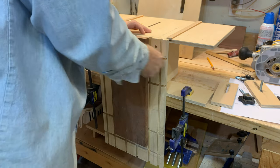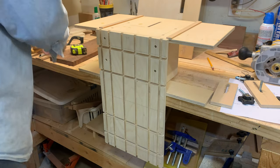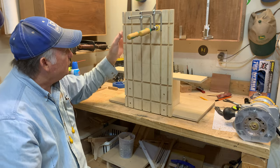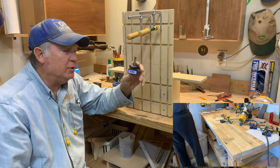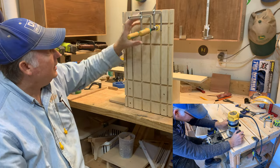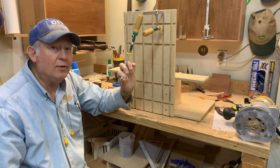We're going to take off our match fit clamps — they're basically holding our workpiece in place. These are clamps that hold it to the work bench. Now here's what the underside looks like. As far as this front panel construction goes, it's just a piece of three-quarter inch plywood with dados cut in here with the dovetail bit you can get from Microjig. They provide in a kit this dovetail bit for the router, a little guide to tell you how high to set it and the depth of cut, and a pair of match fit dovetail clamps to slide in these grooves. Real easy to use, real quick to assemble and take apart — you'll love them.